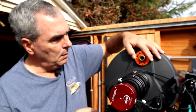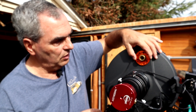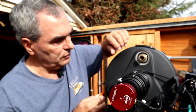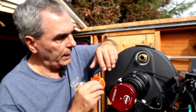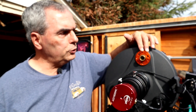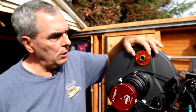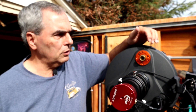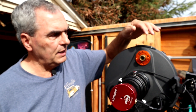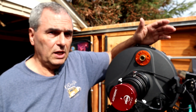As you can see here, my adapter plate also does not fit all the way in there correctly. It rocks because the back of it is resting on the cast aluminum plate, not on the machined surface — so it's not able to put pressure on the bearing structure to hold it in place. I've screwed down the adapter plate that Celestron supplied with the focus motor, tightened the screws reasonably well, and centered the shaft according to Celestron instructions. Take a look — you can see that this shaft can wobble in either direction. That's certainly going to cause some mirror flop, which you don't expect from the focuser. Mirror shift, yes — but not mirror flop.